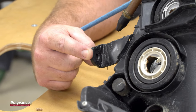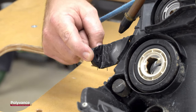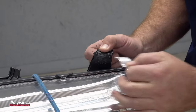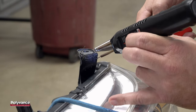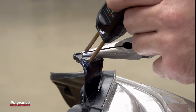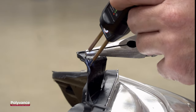Gently cool the tab with compressed air while holding the tab to make sure the angle is correct. Flip the light over and fixture it to the table. Peel the tape off. Use the stapler to reheat the staples and pull them out. Sometimes you can leave the staples in the plastic to provide extra strength, but since the staples are in the face of the tab we'll be refinishing, it's best to take them out.